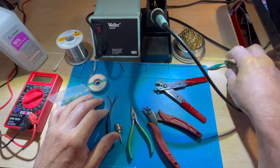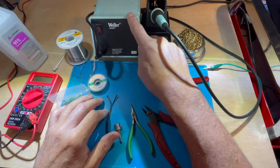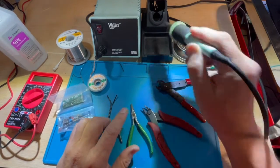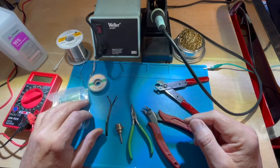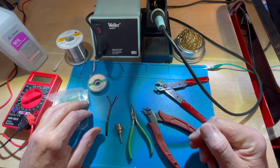And it is connected to a ground over here by means of this clip lead, which is the same ground as the 3-prong ground for the soldering station, and the iron tip itself is grounded as well. So this is a good precaution to adhere to relative to making good connections with anti-static components.